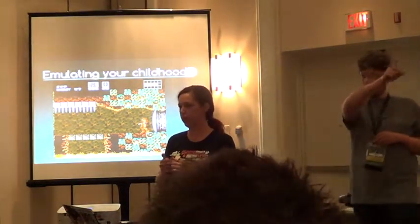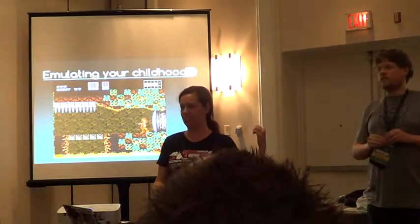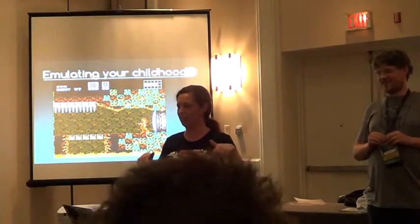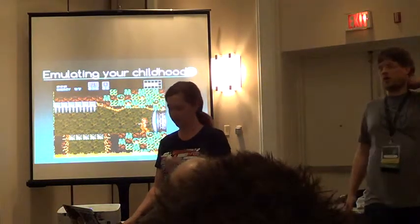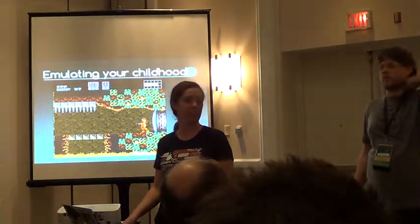And yes, you can find retro NES controllers with a USB connection. So our next intention for Soundwave is to put a big red button inside, and when you smack the button, the screen turns to video game mode, and you can take the controllers out of the arms and play video games on the desk. Does it work with the converter boxes that use human interface device driver types? Yes, absolutely. All the HID modules are enabled inside the Raspberry Pi kernel by default. If they weren't, you could just build them in, but yeah, that works fine.